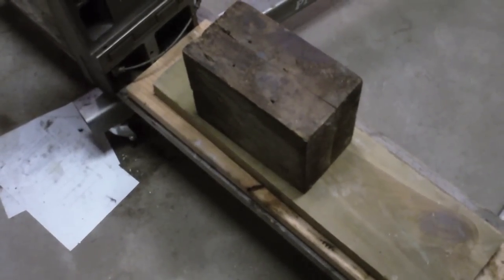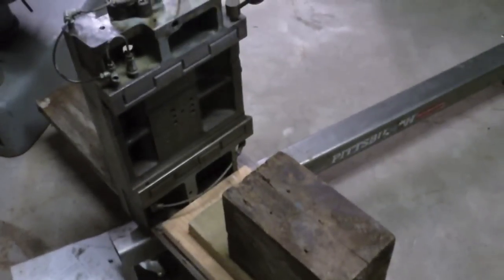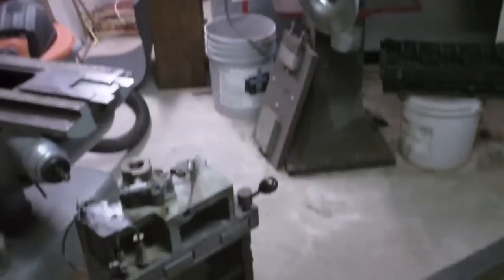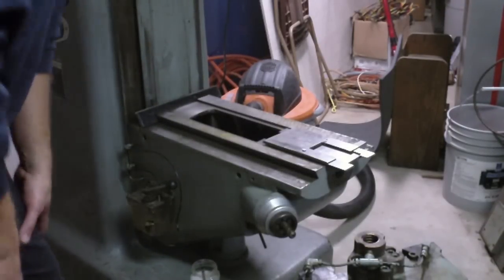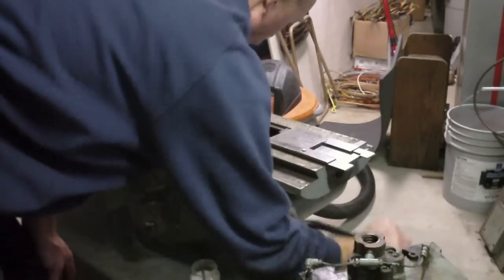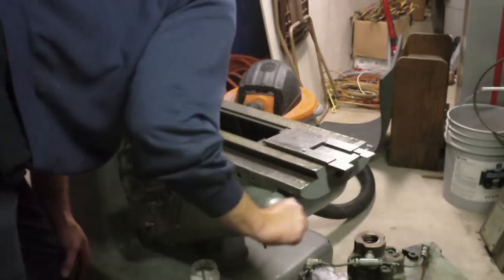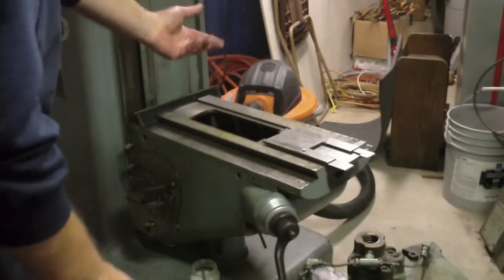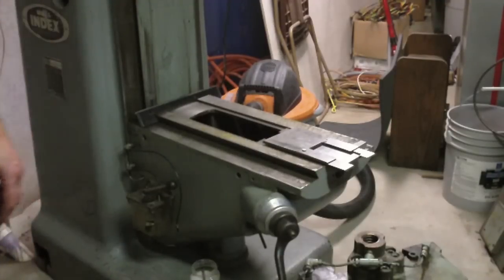I set up a board across the legs of the crane and stacked a couple boards on top of it and this nice big block on it. My plan was to actually put the saddle on that, and what I did to prepare was I lowered the knee all the way down. I wasn't cranking it very hard, but what happened was it basically just all of a sudden stopped, and then I went the other way and lo and behold it wasn't working. I took a look down in here and I could see the shaft spinning the pinion — it looks like I actually broke the key.